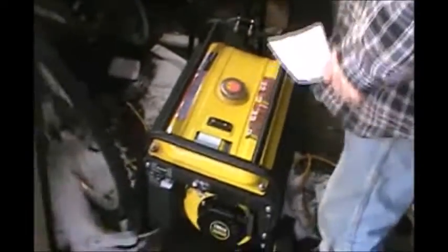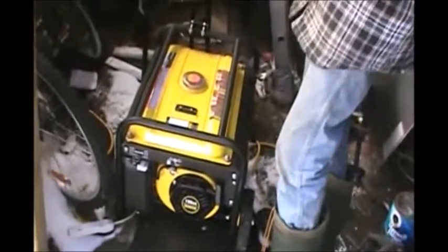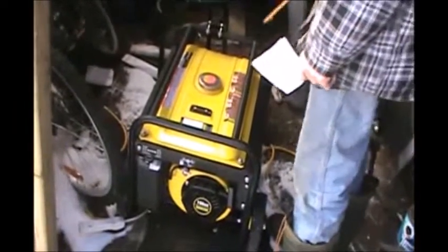I have another one — it's a 4,000 watt, but it's two-leg. That means one leg is 2,000 watts and the other leg is 2,000 watts, there's your 4,000 watts. So I could only realize 2,000 — peak was 2,500 per leg. So actually this is only a 3,000 watt, and it's much stronger on the one leg because it's a one-leg generator — it doesn't have the 220 capability.